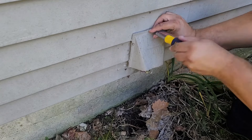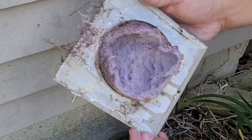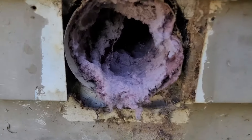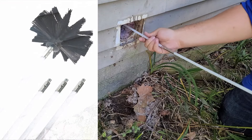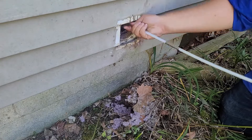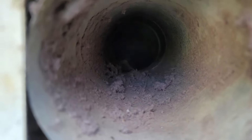I'm removing the dryer vent hood first to get easier access to the ductwork using a standard screwdriver. The angled vent hood is really bad — this picture does not do it justice because the side I didn't record was about the width of an egg after all the lint, barely allowing airflow outside. The pipe is in a horrible clogged condition. To clean this out, I'm using a cordless drill and a dryer vent brush kit. The 90-degree bends can get a little tricky, but the brush kit worked insanely well. I have a link to this kit in the description.